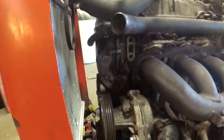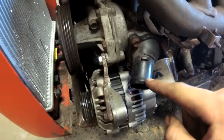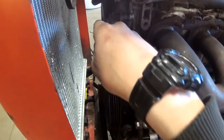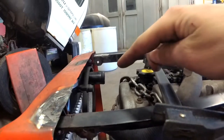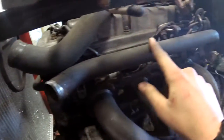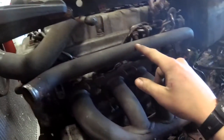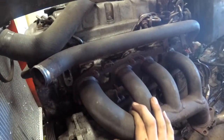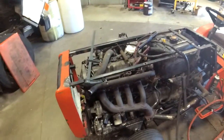That outlet is all curved. It's actually supposed to go to the lower hose over there. I might make something curved around — just go straight over and down instead of having to make some big tube deal around there. For the top outlet right there, I'll probably cut this tube back, then run a hose down or a hard line and couple it on there. Then I just have to block off the heater core feed there.